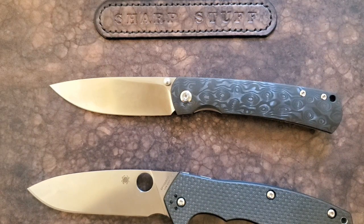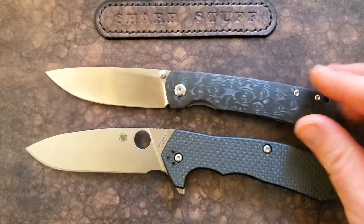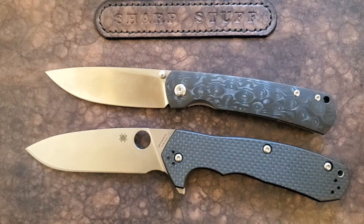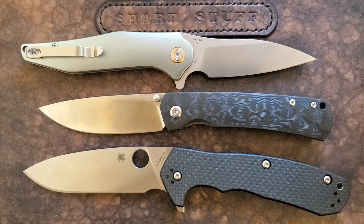Cleaning up that burr made a big difference. You could do this with any knife that has a really stiff detent — soften the edges of that detent hole a little bit, and that can improve the situation. Now, if you're thinking about doing that to your knife, be warned: you're dealing with differences of thousandths of an inch here. It's pretty easy to mess up. You can end up removing the detent completely or making it so stiff it's unusable. These are permanent changes — once you remove that material, it's gone forever, and you've voided your warranty.